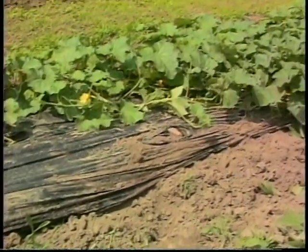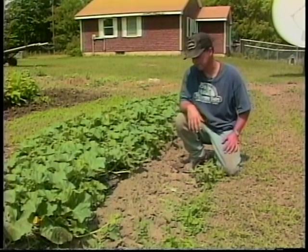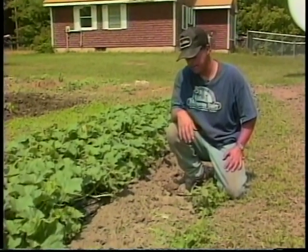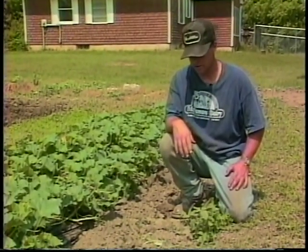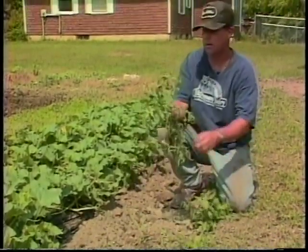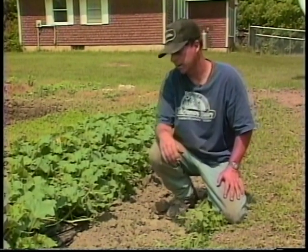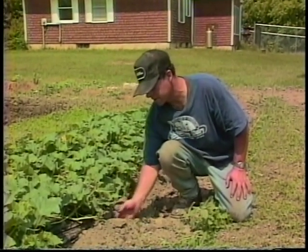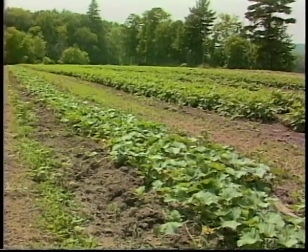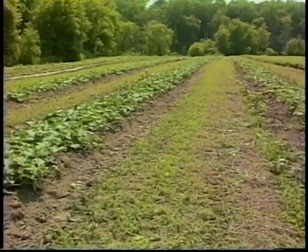Here's an example of some plastic that was just recently cultivated. We pulled the row cover off over a week ago, and because it's strawberry season, we didn't get in here and cultivate immediately. So yesterday we were dealing with some pretty large weeds here. Despite the size and thickness of the weeds on the edges, that front shoe was able to chisel them out. We were able to throw calcium nitrate in at the edge, and the rear sweep came through and buried a lot of the weeds and covered a lot of the calcium nitrate in the edges of the plastic. This is the end result.